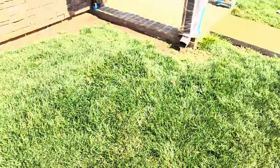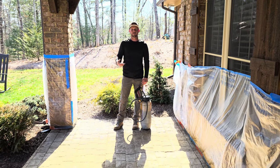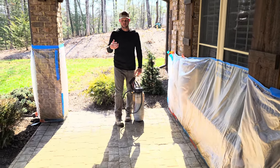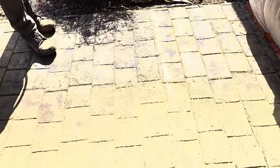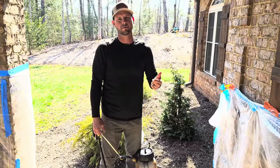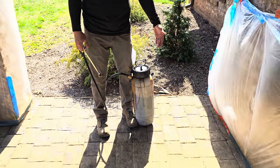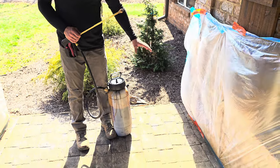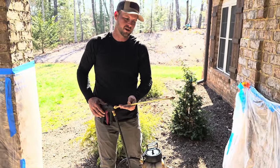So we're about to start putting down this acetone dye. We got our caramel mixed up in there, and we're going to spray the whole sidewalk and the stamped concrete. As I mentioned, we have to change the color from sand into a darker brown — this particular color they picked is called caramel. We sealed a section over here, and as you walk this way, you can see how the unantiqued, washed-off, unsealed area looks compared to where I'm standing that is already sealed with the antique. Obviously it's sealed, so you have to do a different method to get that sealer off — either by chemicals, which is a really messy job, or by media blasting. It's very difficult to get sealer off. The nice thing about this exterior dye is it penetrates into this sealed concrete.